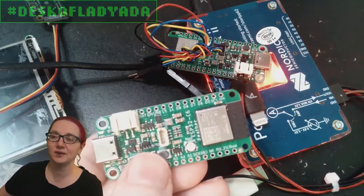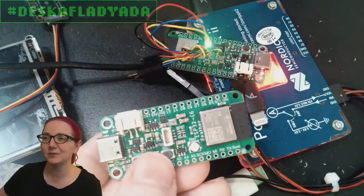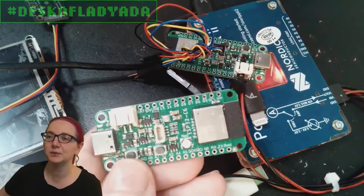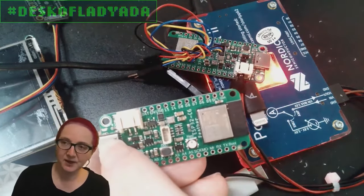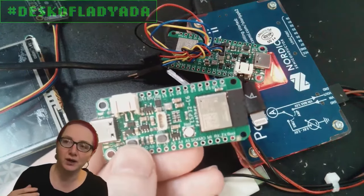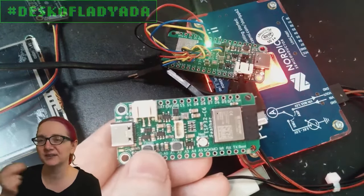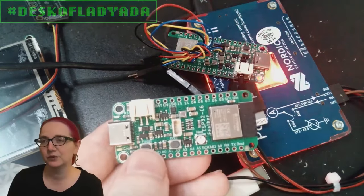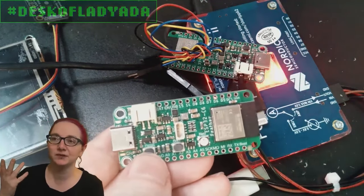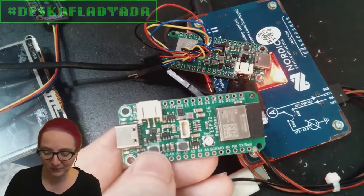It's very affordable. It's kind of like an upgrade to the C3. I kind of liked the C3 but it had very few pins. This one has a little bit more GPIO available. It doesn't have native USB that can do mass storage, but it does have USB that can do serial. So it has a built-in serial port and built-in bootloader, which is still better than the ESP32 or 8266 where you needed a separate chip to do the USB serial conversion.